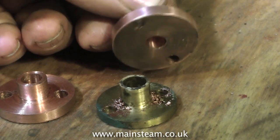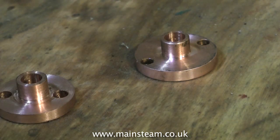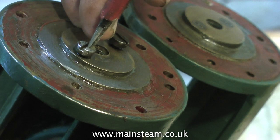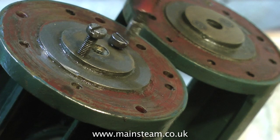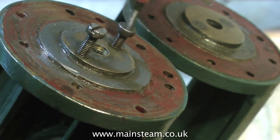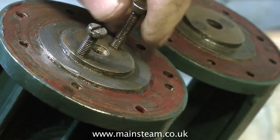What I'm having to do is copy these parts. I cannot make them to standard dimensions because each part is almost completely different — a different diameter with the holes in a different place. It looks to me like the second builder of this engine, the one who did the cylinders, was not a good engineer at all. In one of the cylinders it has countersunk 2BA bolts, and in this one it has some cheesehead bolts just stuck in there. These actually foul the piston.